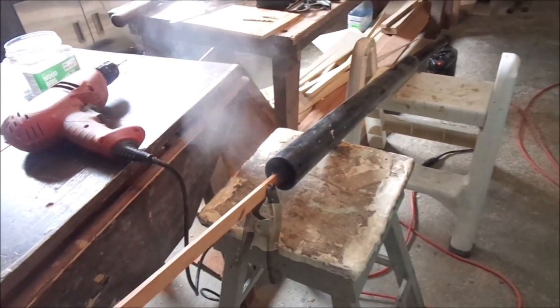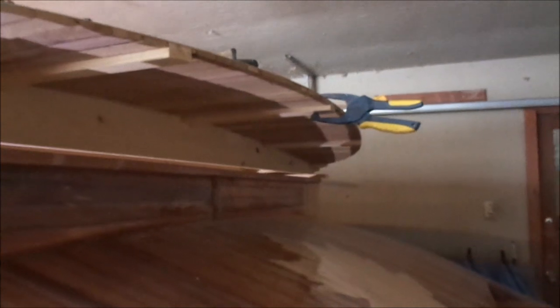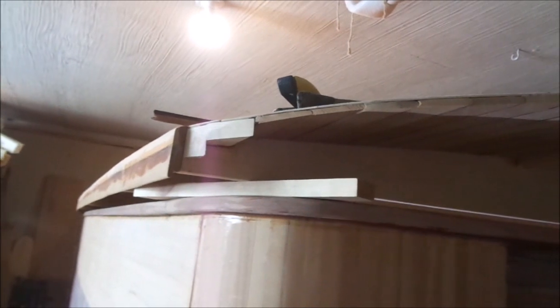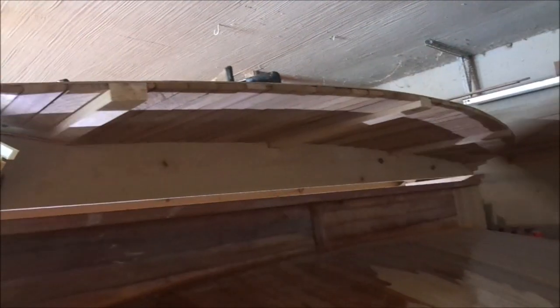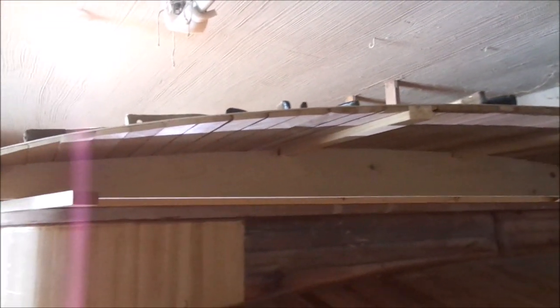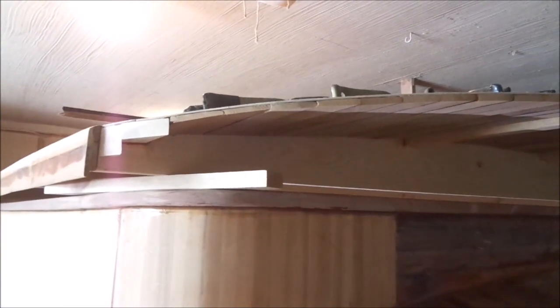Everything's working well. When I take it out of here, I'll quickly slip it through this clamp to generally hold it in place, then clamp it around the edges as I bend it. Later I'll put a couple of screws into it to hold it. I'll put a second piece on there as well so that the final result will be a half-inch thick piece of cherry trim along the front.